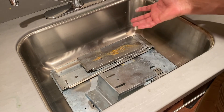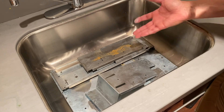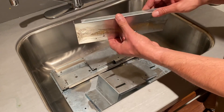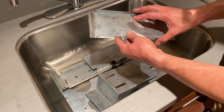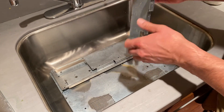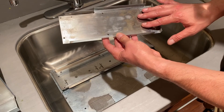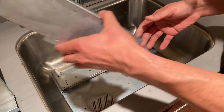I only had these in the bath for about 10 minutes, then removed the pieces and exposed them to the air, and within 10 minutes or so the rust started appearing — but not on all the parts. This part here is clearly showing some rust, so it will need to be treated. This side's pretty good; it seems like the galvanization is doing a good job here, but over here we're going to need to touch that up. This part overall looks good and seems to be immune to rust. This one had a lot of corrosion on it so I had to go a little deeper on the removal — it looks like I've exposed some bare steel here and you can see the rust, so that will need to be treated.